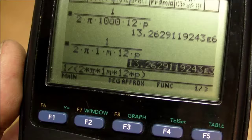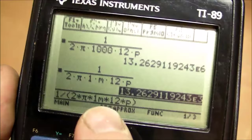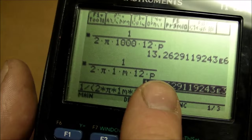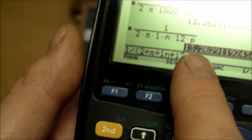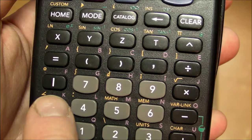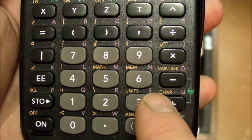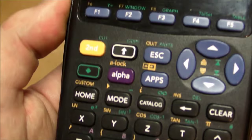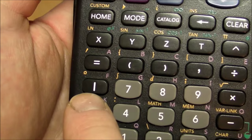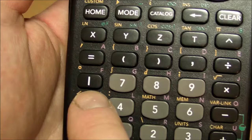On my trusty TI-89 I've got M and P stored — that's just mega and pico, 10 to the 6 and 10 to the negative 12. That's how I enter exponential information for the most common exponent values in engineering. I've got femto, giga, mega, nano, pico, and micro for U. I find it much easier to enter the alphabetic character for any given engineering multiplier rather than doing the exponent, maybe a minus sign, and two other digits — just alpha, number, and you've got it.